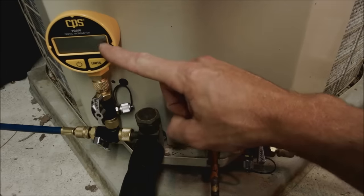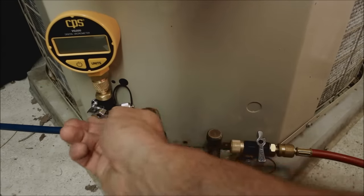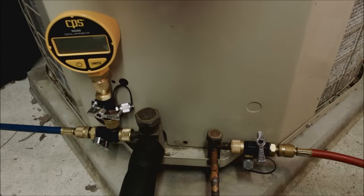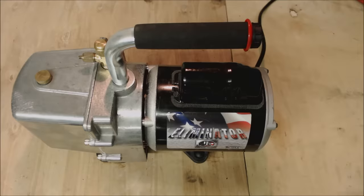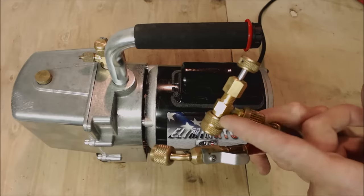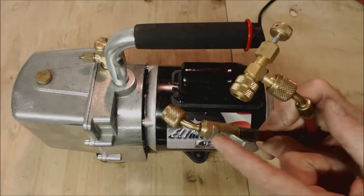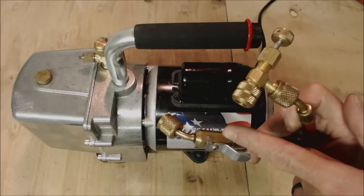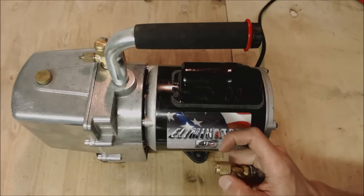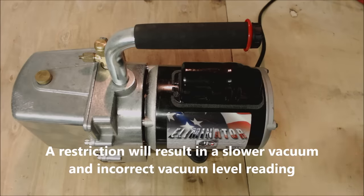Test the micron level for 10 minutes. After that, isolate it by turning that valve and then introduce refrigerant into the system. If you want to see the full vacuum procedure, check out the AC Service Tech vacuum playlist — it's linked in the description below along with the different tools used in this video. Tip four: try not to use extra fittings such as a valve core depressor tool, an on/off valve only rated for positive pressure and not vacuums, or the larger quick disconnect heads. They could cause a leak or a restriction in the line.